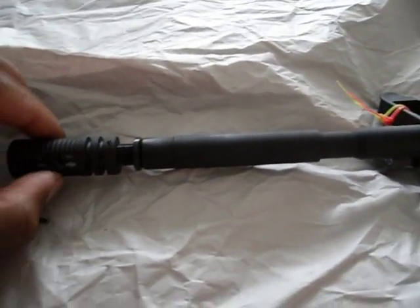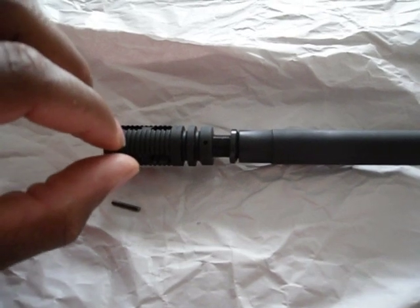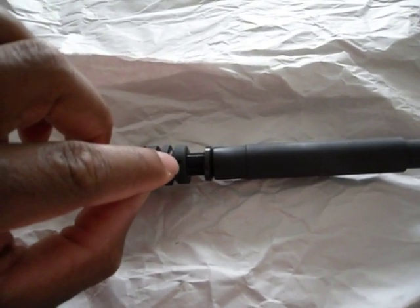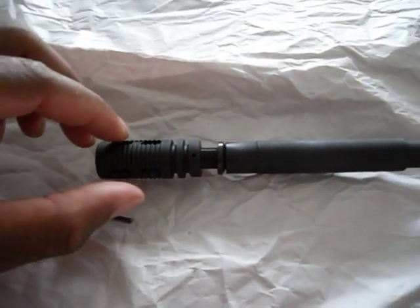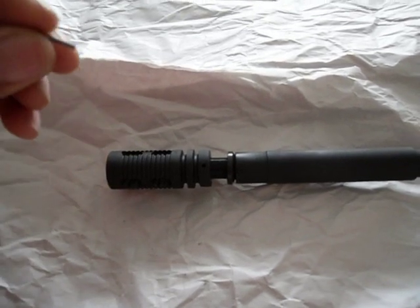When you install it onto your barrel and properly time it, you want to use your drill and run it through the very same hole. You want to drill just past the threads — you don't want to drill too deep, just past the threads.